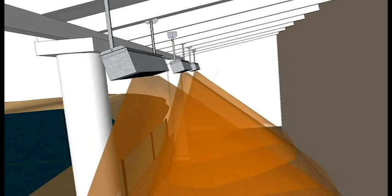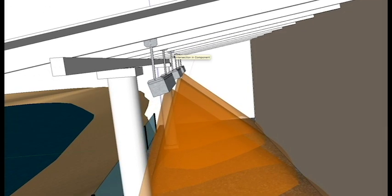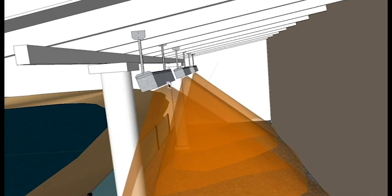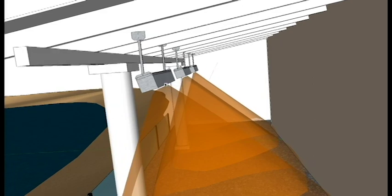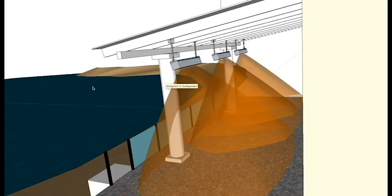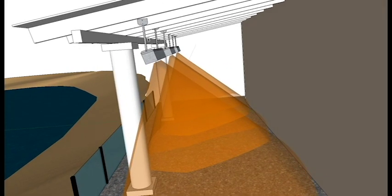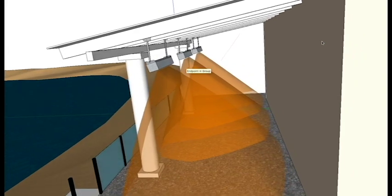Let's say you get into the 5 to 10 mile an hour wind movement or air movement, then the heaters aren't as efficient because there's a ceramic plate in here that has to be heated properly, and if the wind is pushing those gases around, it's not going to function properly. Now on perfectly calm days that would not be an issue, but I know in this location there's going to be a lot of wind, so it's something to consider. Also, being that these are gas heaters, again, we need to keep that clearance from the combustible material above the heater. So that's the SunPack heater.